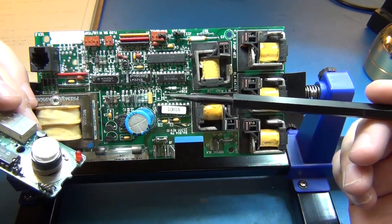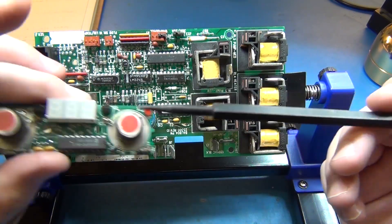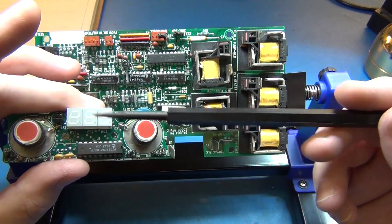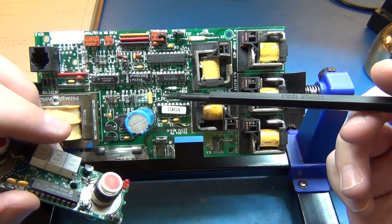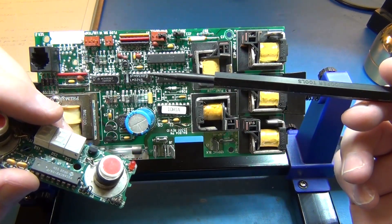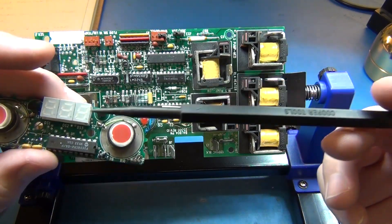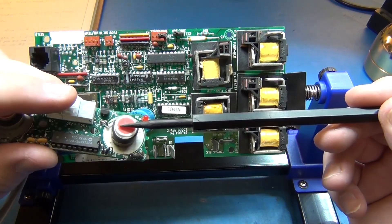So there's lots of safety and some robust building of this thing. If this hadn't been modified, damaged, and shorted, I don't think it would have taken out the micro pins. I think all they did was short out the microcontroller pins and destroyed the input to the controller that was sensing what you were doing with these buttons.